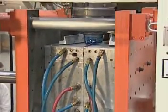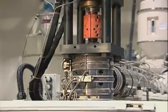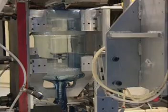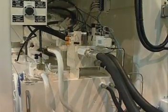The flow-through die head prevents material degradation and eliminates frequent disassembly and cleaning. The integrated hydraulic system is supplied by Rexroth to ensure global availability of parts. The system uses fully proportional hydraulics to provide infinitely variable speed and position control.